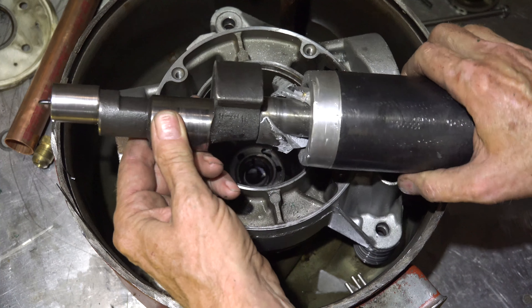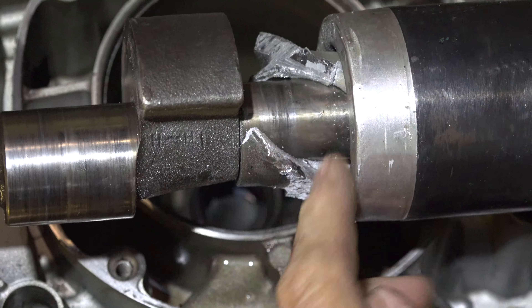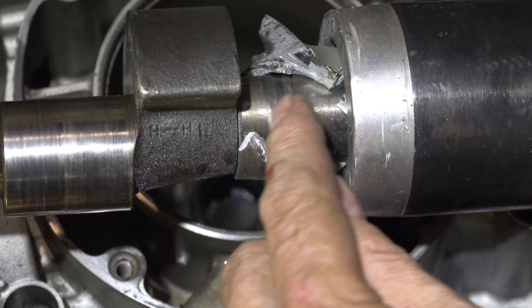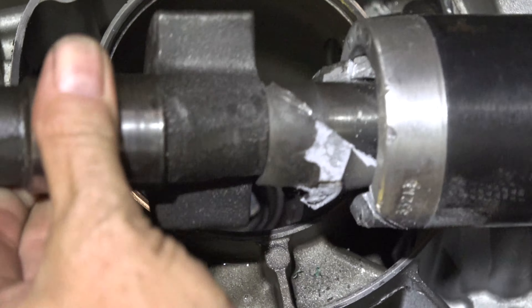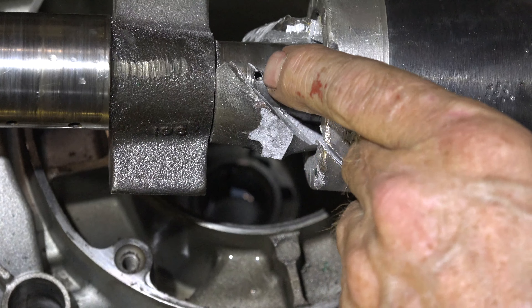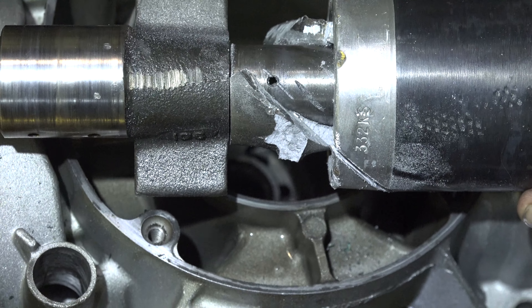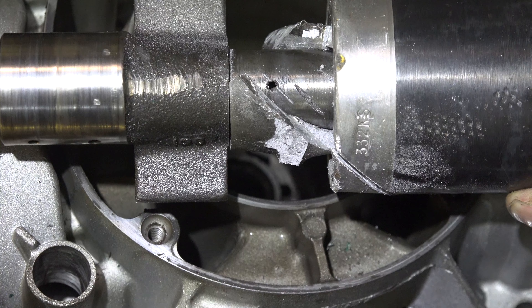This one hasn't been heating. Now this one here — getting a little closer — you can see some heat on this thing. I've broken away this other bearing and it's rough; it's been heating and has not been getting enough lubrication. That hole right there is for the lubrication to come up — the oil pump pumps lubrication up there. It's the highest bearing, so if there's a shortage, that's the one that gets shorted. It also has the most load on it.